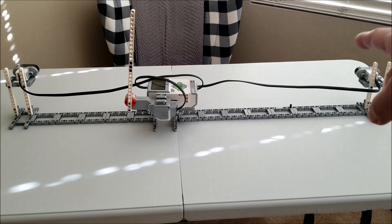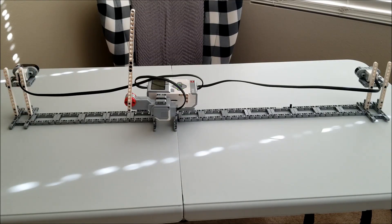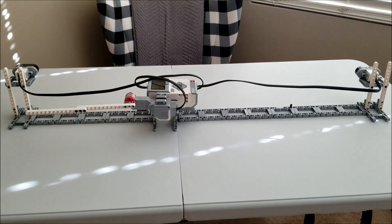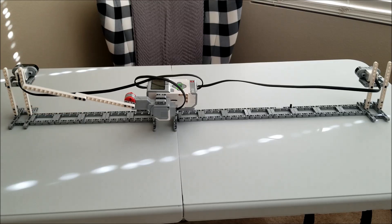This is going to activate this gate right here to go down, and when the ultrasonic sensor over here to the left sees that the train has gone by, it'll activate the gate to come up. So when the train comes by and this first ultrasonic sensor picks that up, it'll cause the gate to go down. Then the train passes by the second ultrasonic sensor, and in the program I have it set so that if it sees past the train — I believe I set it for 10 inches — it'll activate the gate to go up, allowing cars to go back and forth.